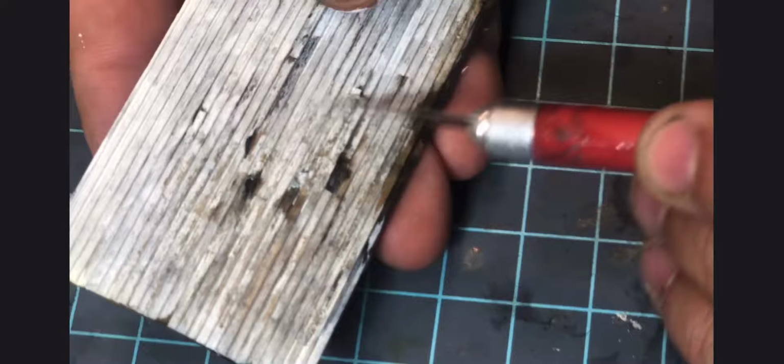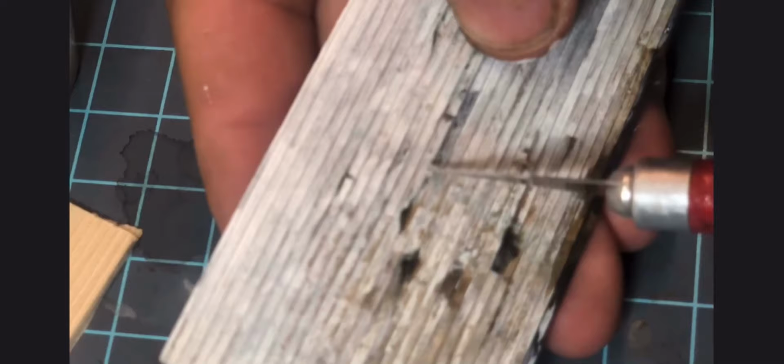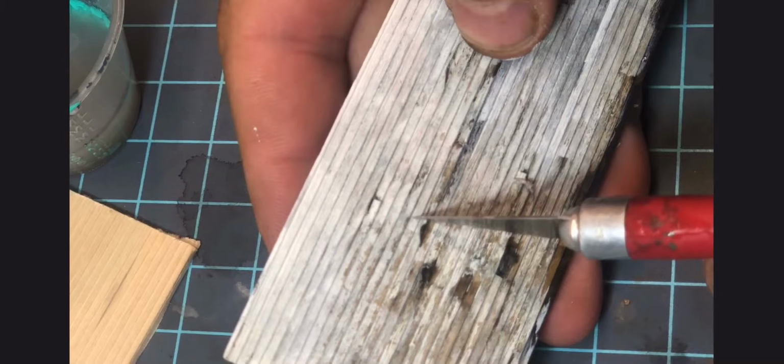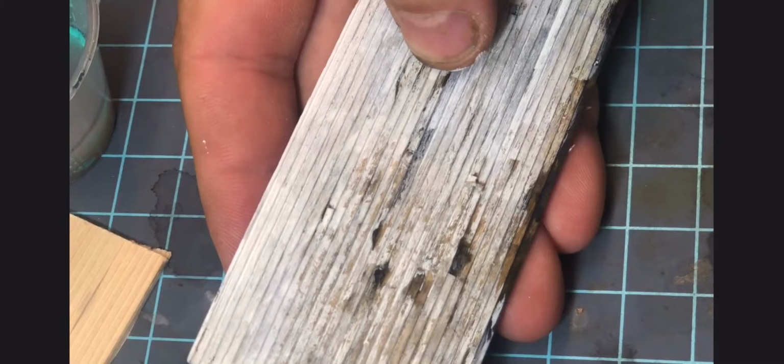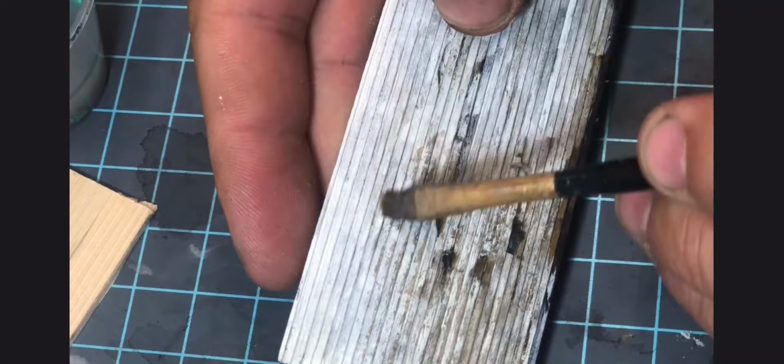And we're just going to lightly scratch away just random areas here. You don't want to let the water set too long. Oh, there's that board we pulled down. Look at that. You don't want to let the water set too long, or it won't pull up anymore. But if you let it sit for like 30 seconds, it'll pull up really nice. All right, so I'm going to get this brush, going to get it damp a little bit. Here's what I'm talking about up at the top. I guess you can even rub your brush on there and it'll pull up a little bit of the paint.